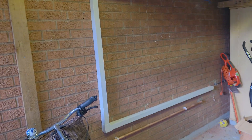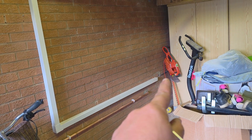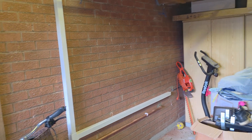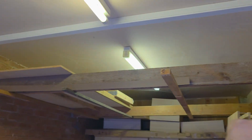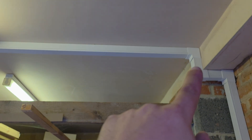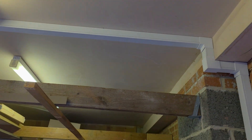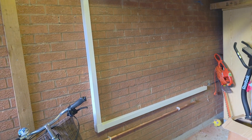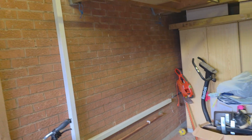They're a really neat solution and I'll try and get some short-form content of this. You can see there is another sub main there that goes off to another DB — they've not used any trunking on that one, and I believe there are plans for this customer to do some sort of conversion in here, so this may change yet. That's why we opted to go along the ceiling rather than attaching onto the timber, because I think that's coming out. Fortunately though — more by luck than judgment — we actually hit the timber right across this run, literally above the trunking, so that was an absolute bonus. That's the trunking leading to the under-stairs switch fuse, which is going to fuse down to the grid input for us because we've only got a 60-amp supply on this premises and we've got to drop that down to cover it off.